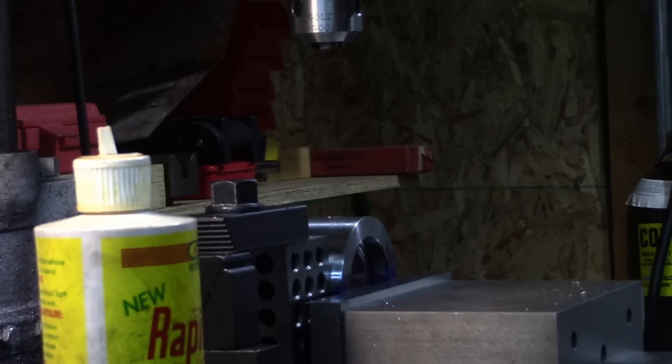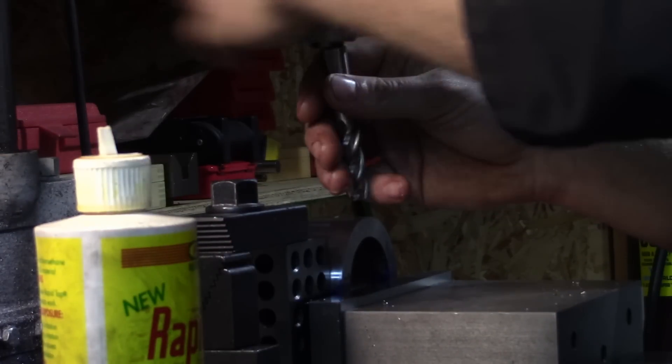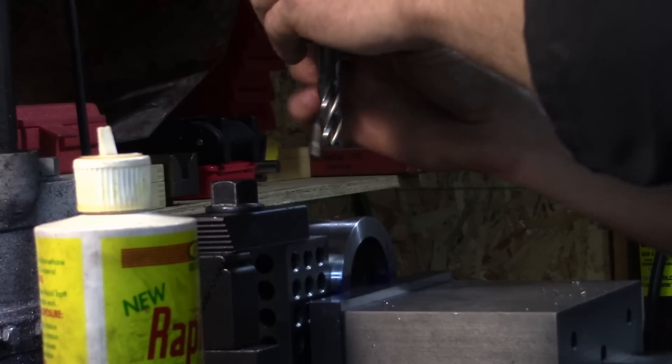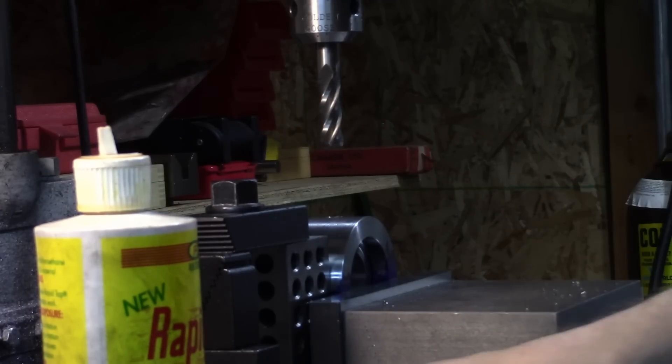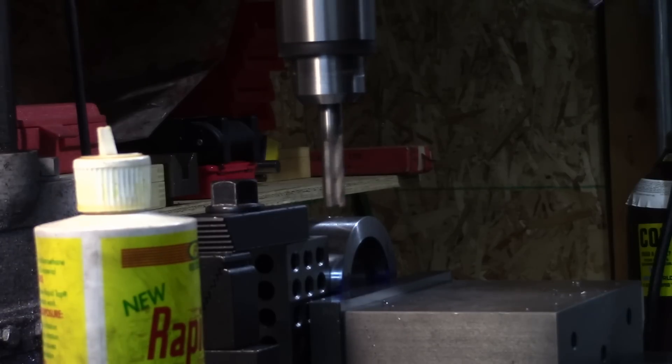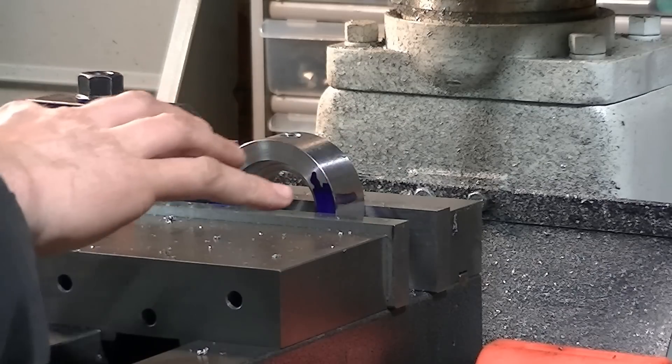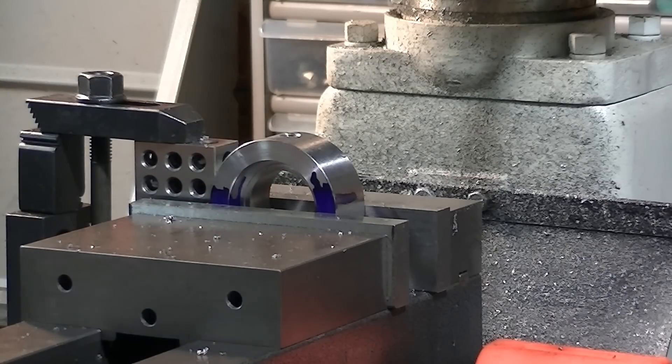I don't do this very often, but I'm going to use a milling cutter in a drill chuck — just a light cut. I'm not going to bother removing the chuck just for this; I'm only taking a few thousandths off. We'll flip it around and do the through hole. Drill, bring it out to size for the small diameter, drill down the depth we need for the large diameter, then tap it and spot face, and we're done.